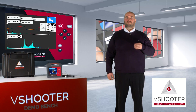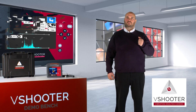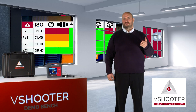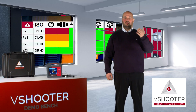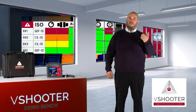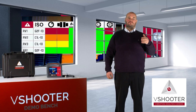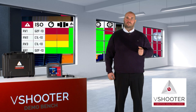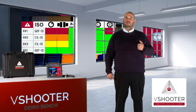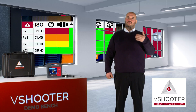In this table, it will be possible to show all the possible defects you can have on the machine. For example, balance or unbalance problems, misalignment, looseness, or something else. You will also be able to detect bearing problems like a fault or lubrication issue. So if you have one of many problems on your machine, you will see it in this table. Of course, you also have the possibility to check the value of your data and the value of your analysis.